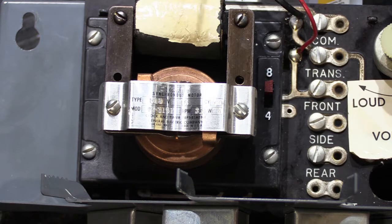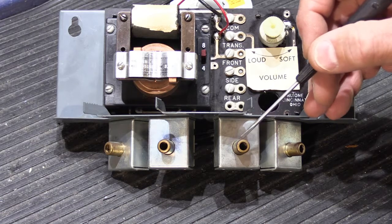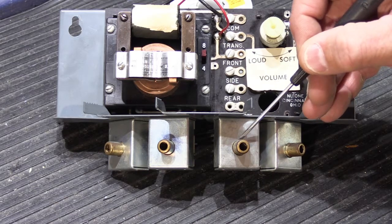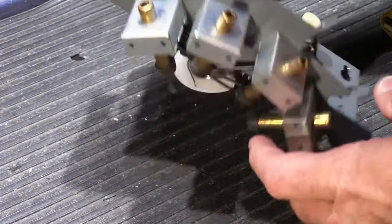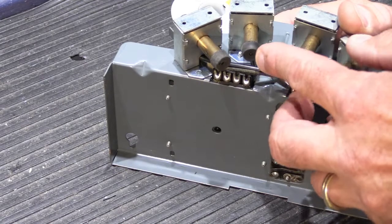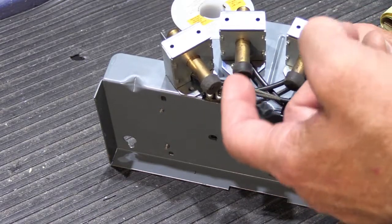This would have used a NuTone 301 or 301N transformer at 16 volts, 30 watts. On L model chimes you still have your four solenoid assemblies, but gone are the brass end caps. Now there's a formed tube and the opening in the end is rolled over to make it smaller so the plunger can't fall out. The solenoid assemblies are actually somewhat smaller than K model chimes — the coil is not as large and therefore not as powerful — but you still have the rubber caps on the ends with the springs, plungers, cushion, and cap on the back.